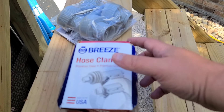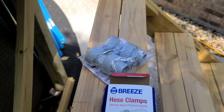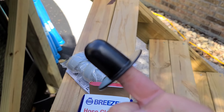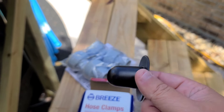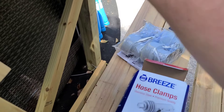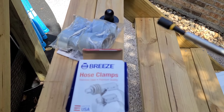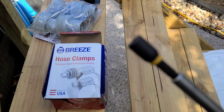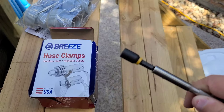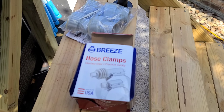What we're going to need is the hose clamps — though you can use the plastic clamps that come with the adapters if you don't have hose clamps. My pump came with two stoppers for the outlets to the filter, and I'll be using those. To cinch down the hose clamps you can use a flat head screwdriver, but in this case I'm using a five-sixteenths hex wrench.